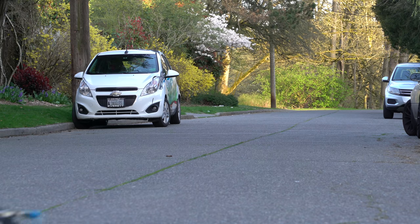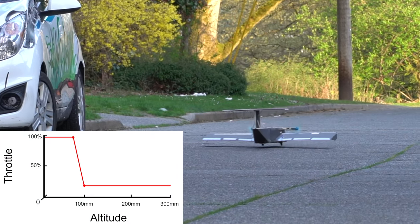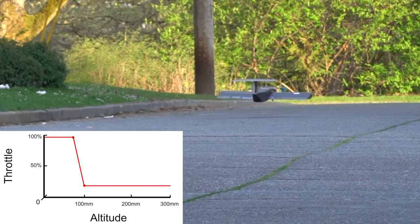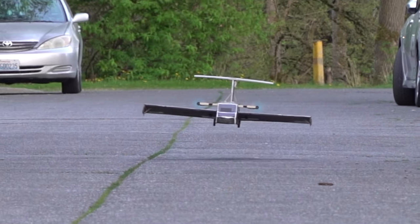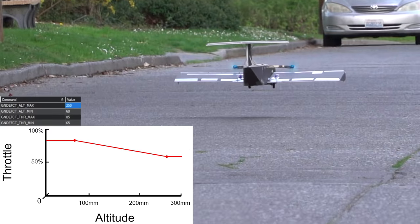Finally, we got a calm evening and had the chance to try out a bunch of different settings. We started with a really steep slope, which basically correlates to a super high P-term. If you've ever tuned a drone, you'll know that having your P-term too high will cause oscillation — and that's what we were seeing. After that, we gradually reduced the angle of the slope until it started holding altitude fairly well. These are the final parameters we arrived at.